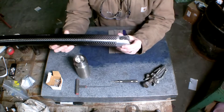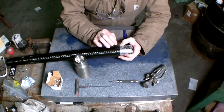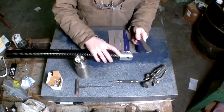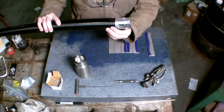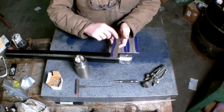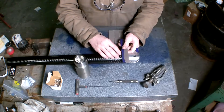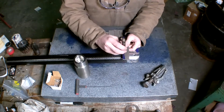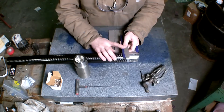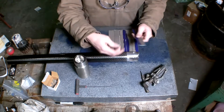See that? Nice fit. I didn't want to just screw this carbon fiber in here, and I didn't want to just use washers. What I came up with is a band that will wrap around here, and it will be right exactly size on size — this fitting is exactly the same OD as this tube. I'm going to wrap this around here and then drill holes. There will be two rows of six. Once that's on here, I will just match drill. Once I get them all done and rolled, I'll make a pattern, wrap it around each one, center pop mark them, drill them, and then drill and tap into this aluminum. What it does is reinforce the end and also gives quite the aesthetic look to it.